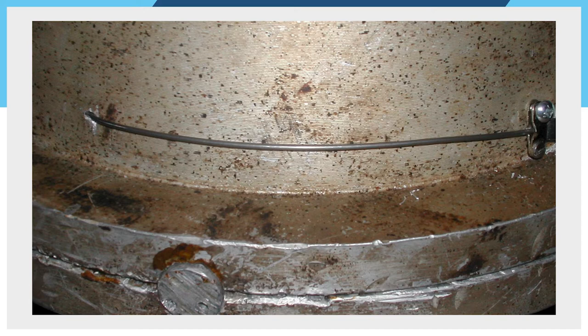So, what to do? Firstly, check that you have actually released all the clamps — a stick-up is sometimes as simple as that. If not, here's why you should never stick anything in between flanges to lever the parting line open. Look at the flange in the picture. You can see signs of damage where screwdrivers have been pushed in to get a purchase on the problem. The defects already formed will become the site of future problems for sure.